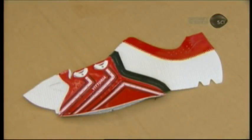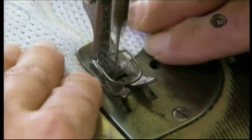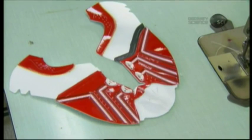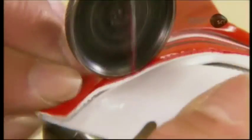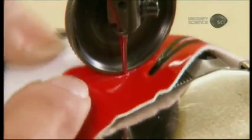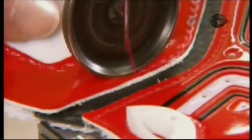With one half of the cycling shoe now complete, it's ready for the other half. She joins it to the other half at the toe end using high-density nylon thread. The next part is the heel cup — a piece of molded polyurethane that adds strength and form to the back of the cycling shoe. She stitches on trim and joins the heel cup to the rest of the cycling shoe.